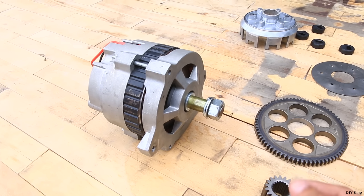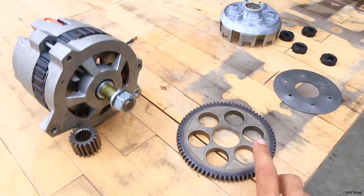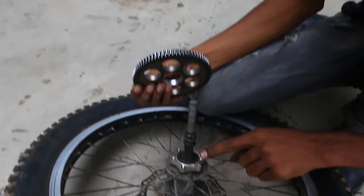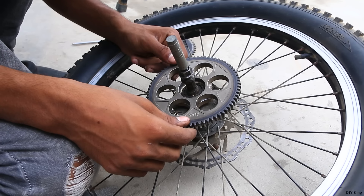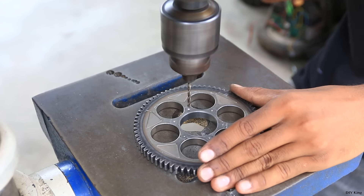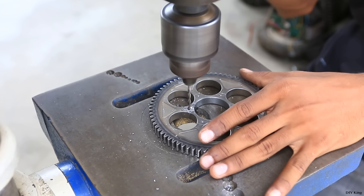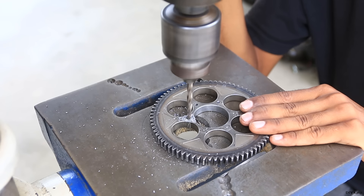Since this alternator offers a lot of RPM that we have to reduce, we are going to mount the pinion right onto the shaft of this alternator, and this large gear is going to be mounted onto the wheel. Our luck is going well as this gear has the same size as what we have on the adapter of this wheel. To mount this big gear on the wheel, we are going to drill six holes so that it matches with the adapter on the axle. Vajitabha took the gear to the drill press and started drilling — I was worried the bit might be too small for the hardened gear, but I was absolutely wrong.